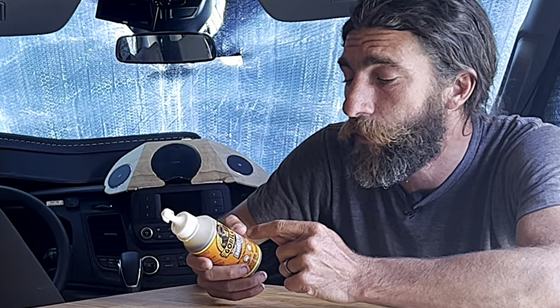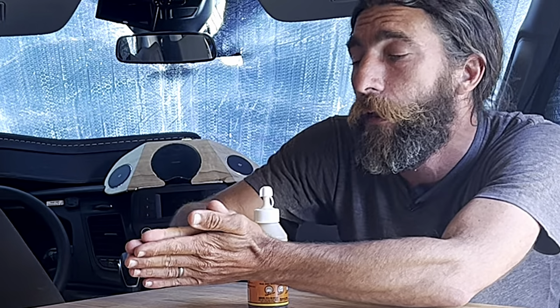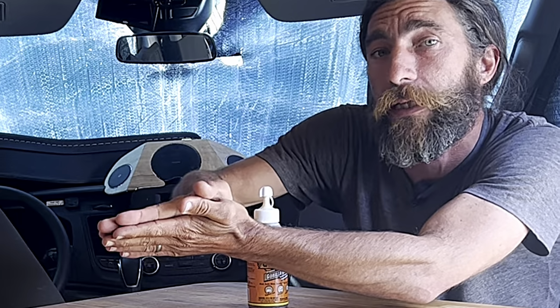Now, that's great if we want it to fill those cracks, like when we're putting in those screw anchors, those drywall anchors. It's great that it expands and fills into those cracks. We want it to do that, so we would use it in that situation. We wouldn't use this where we were putting two pieces together, either with finger joints or just laying them flat on each other, and that expansion would move them apart in a way that we didn't want the glue up to work.